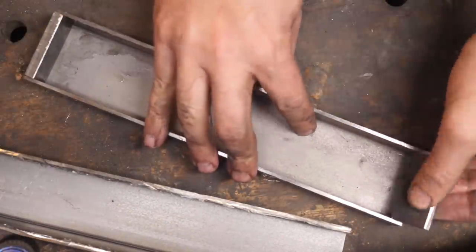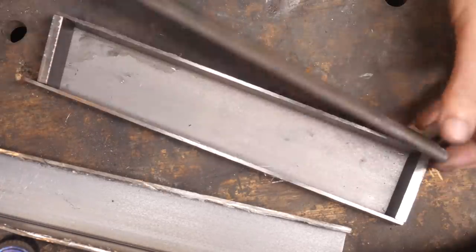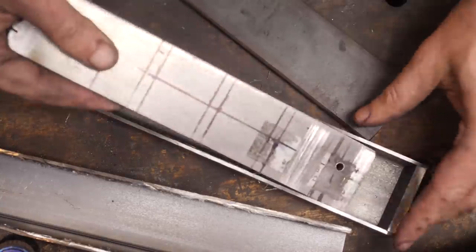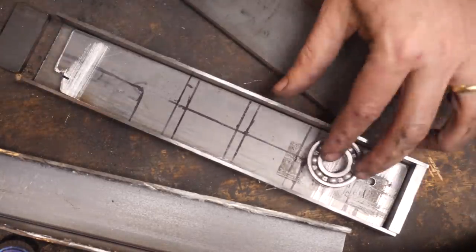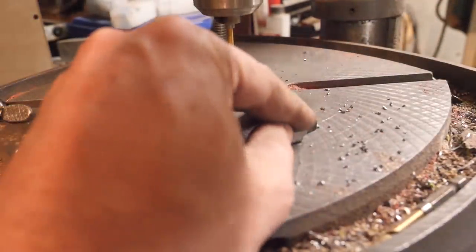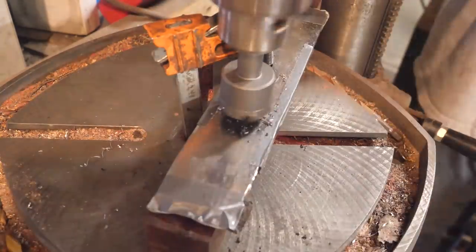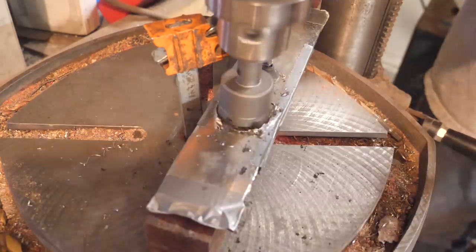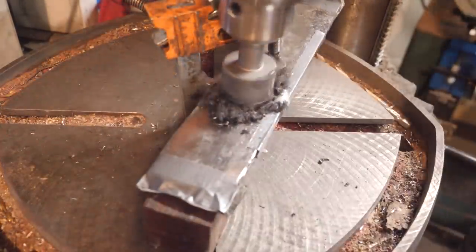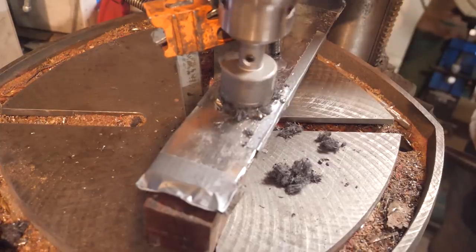First, these bearings are 35 millimeters in diameter, and I bought a 35 millimeter metal hole saw instead of one slightly smaller, which does exist. When accounting for the wobble in my drill press, these holes are going to be ever so slightly wider than the 35 millimeter bearings. The gap is tiny, but enough to make straight up plug welding a little too difficult for a guy who's never tried it before. Remember, that fit has to be super tight for a plug weld to work, or at least that's my understanding. I should tell you, each of these holes took about 15 minutes to drill.